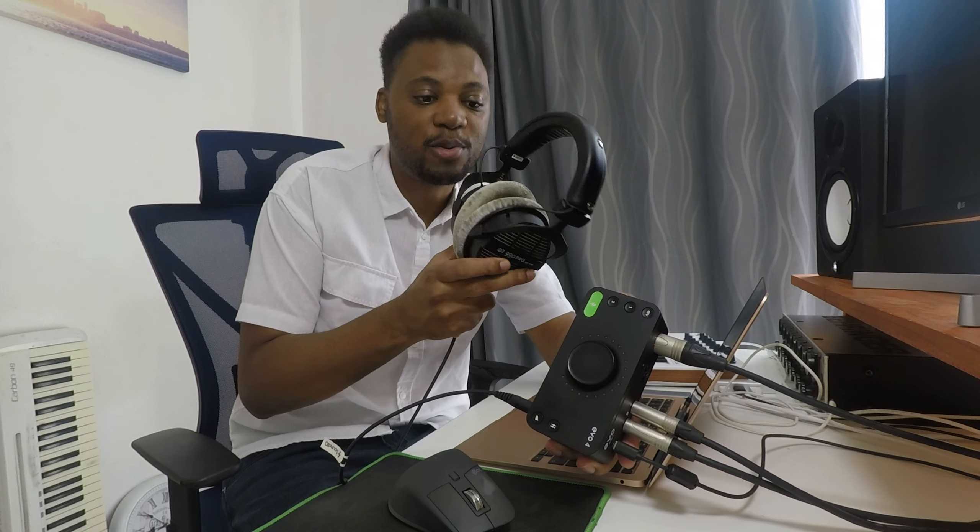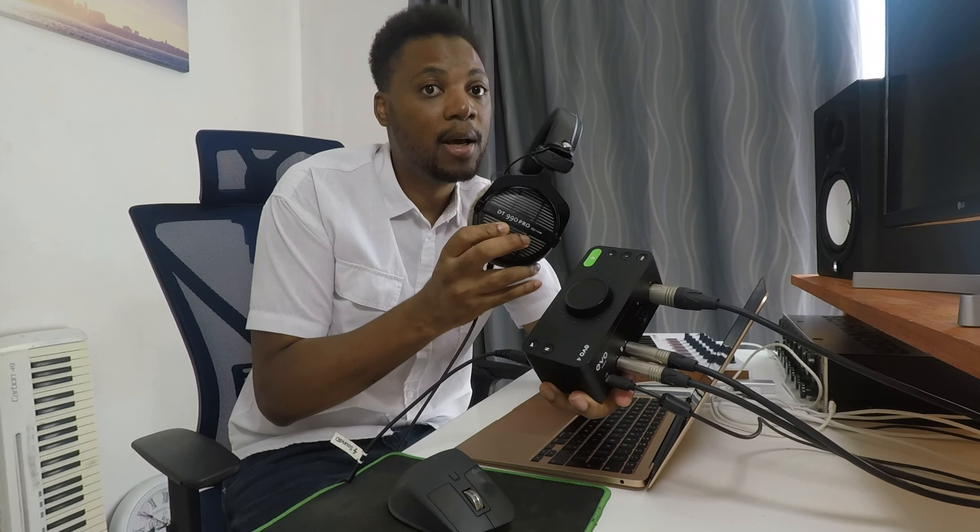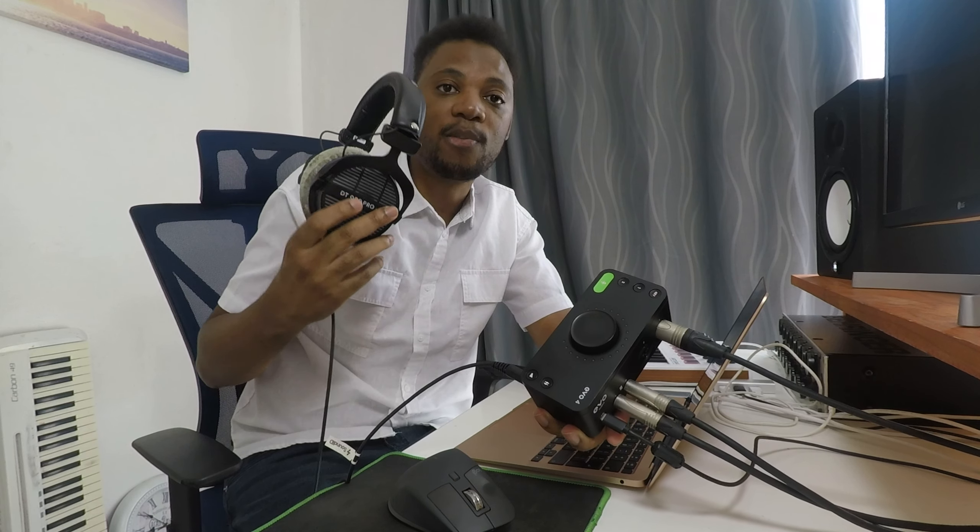You also want to make sure the audio interface can power headphones that need a lot of juice in terms of impedance. My headphones are 250 ohms, so they require a really good headphone output with a lot of power. Some audio interfaces might struggle to drive them. If you have high-impedance headphones, check this carefully — otherwise you might want headphones with lower impedance, like 32 ohms. I love my 250 ohm headphones; they work great and sound quality.